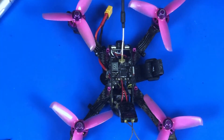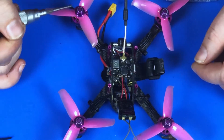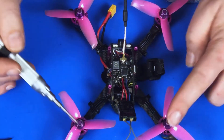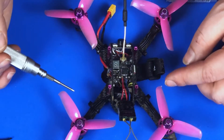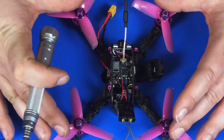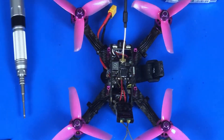In order to make any change we do need to put a battery pack on. I have my props on and I'm comfortable doing that, but do not try this at home. The moment you're attaching a battery to this quad and you're not planning on flying it, you should always remove your props — because if something happens and the motors spin up, these will basically become flying razor blades in your face. Please remove your props when you work on your quad.